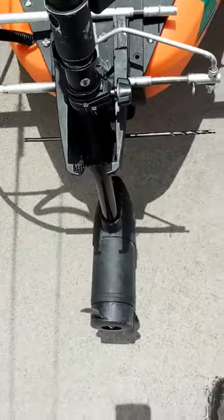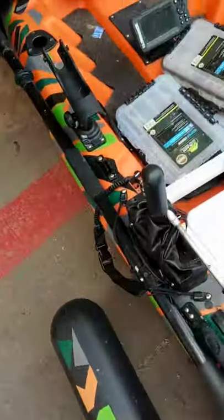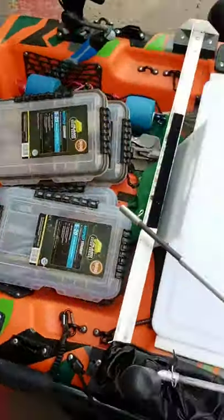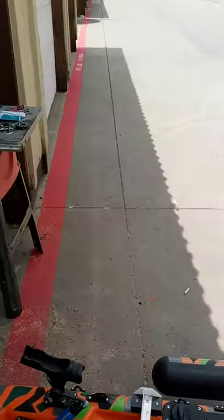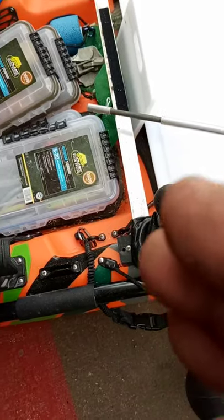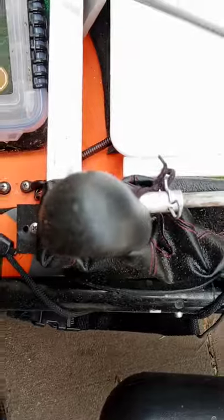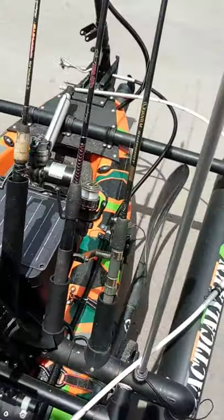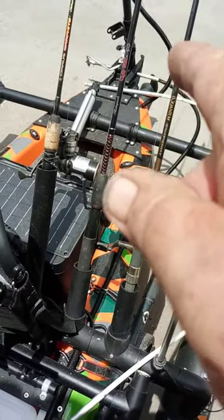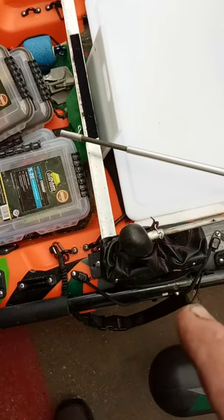Come around with a loose cable, stand your stick up straight to the vertical position — that's where you want your stick — and bolt this onto the stick. Go back and double-check to make sure you're straight. There's a steering lock — lock it down. Come back, make sure this is straight, and lock this down too. A lot of guys don't have a locking mechanism on their sticks, but you could use a pair of vise grips or whatever just to make sure that stick doesn't move.